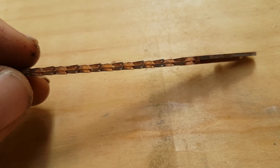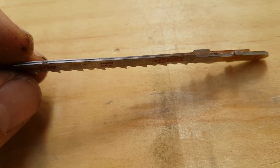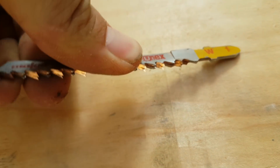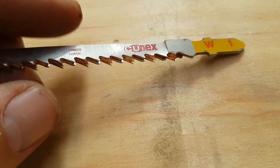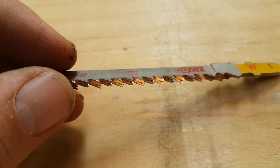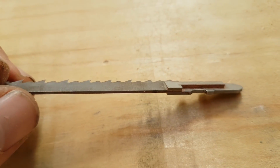They're a really fat kerf at the front, about 3mm, but then it tapers back to a really thin kerf, and you can see the lamination in the steel, and they're stiff as a board. You can't flex them at all. That's what makes the cut just so straight, yet you can still do really nice curves with them because of this back bevel. Just absolutely incredible.